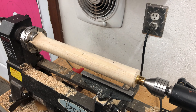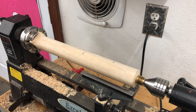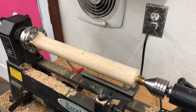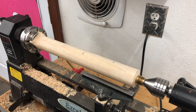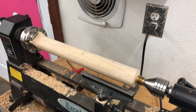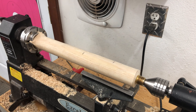Now I've got my handle mostly turned and we have to deal with this ferrule up here. I was telling you that you can cut this with your tools, and you certainly can — I'm going to do it right now. But I would not use your carbides; use your cheap Harbor Freight tools, preferably the ones you can resharpen. Even though you can cut this with regular lathe tools, it's going to require a lot of sharpening — you'll dull them fast and have to touch them up constantly. So very, very light cuts — basically just scrapers. Since all we're doing is taking threads off, it should cut fairly easy until we get down to solid metal, and then we just sand it out with sandpaper.